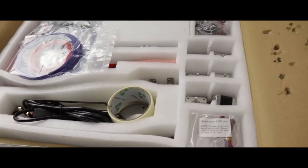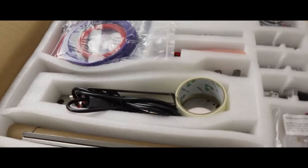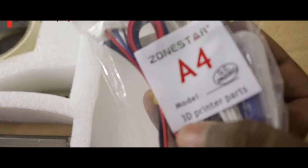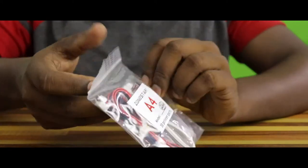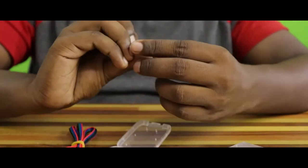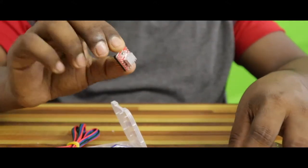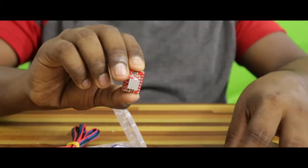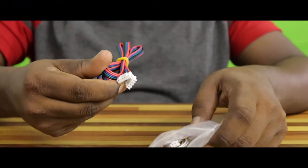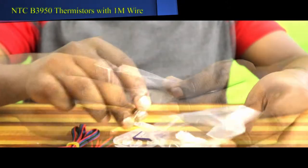The consignment comes neatly in many separate compartments with unique markings. Let's take a quick look at the components of this consignment. This compartment has a package labeled A4 and it contains a memory card that has 512 MB memory, which is sufficient for printing purposes. A spare motor driver module, some cables for connecting the stepper motors with the controller board, and a temperature sensor for the hotend module.